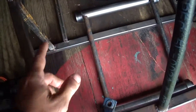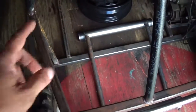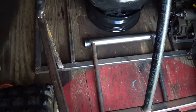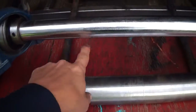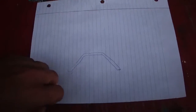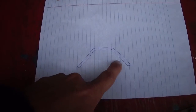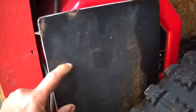That stuff there is 1/8 inch thick, and I'll show you what else is going to go on it. After those are all welded in, I'll need to make a rear piece that looks like this — it will come up like this and across and back down. I've seen other people put an X through here, but I'm not going to do that. What I'm going to do is use this piece of 1/8 inch thick steel and just cut out the shape into it and fasten it to the back.